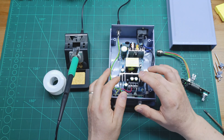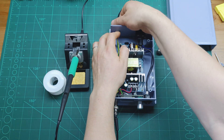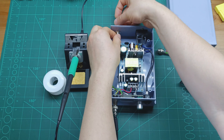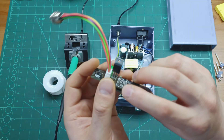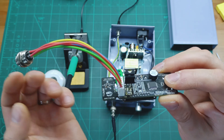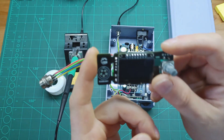Now let me show you how to wire the connector that goes from the soldering station to the soldering stand. When you touch the place where you change the tips, the display will show you're changing tips, and when you put it on the stand it goes into sleep mode. I've already opened the soldering station — I changed the connector to a barrel jack like this one, which has two wires: the outer and inner.